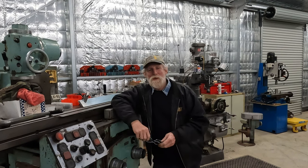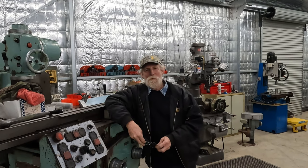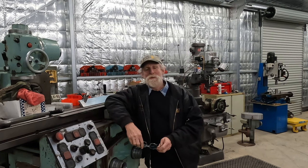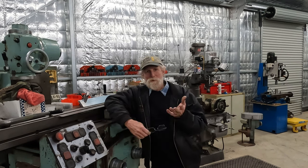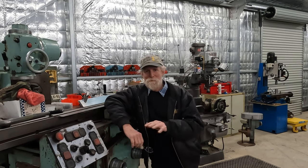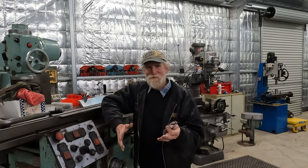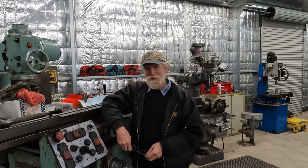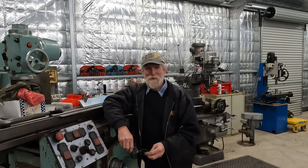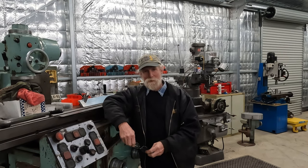We'll bring this one to a close here. I'm just going to set up the bridge port with the indexing head so we can do the spanner flats. The reason I'm using the indexing head is because we need to get back into our JFMT lathe and get this bloody pinion gear cut for the carriage or the apron. So I'll kill two birds with one stone, set the indexing head up and do both jobs. Well, not at the same time, obviously. I can't cut a gear and cut spanner flats on the same machine at the same time, but you get the drift. So anyway, cheers, thanks for watching, and we'll finish this shaft out next video, and then we're back onto the JFMT pinion.